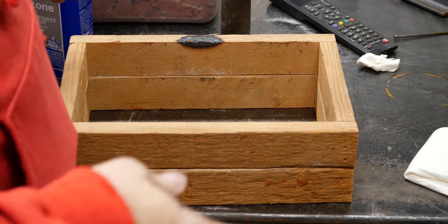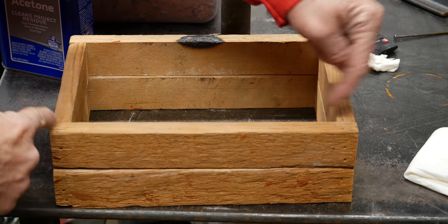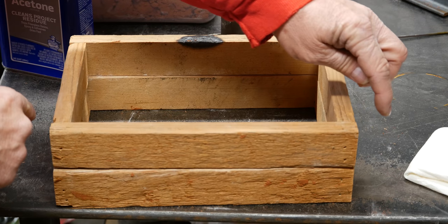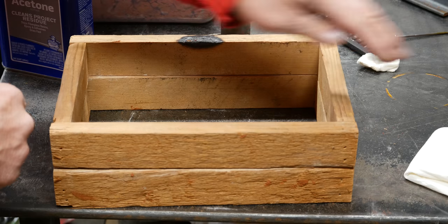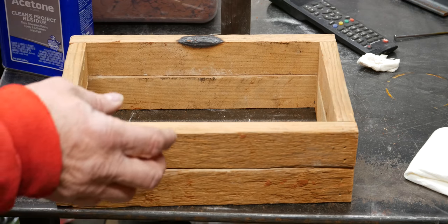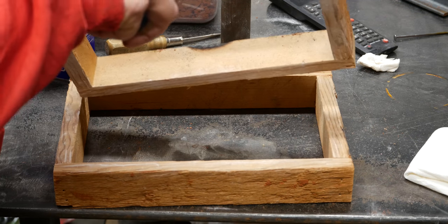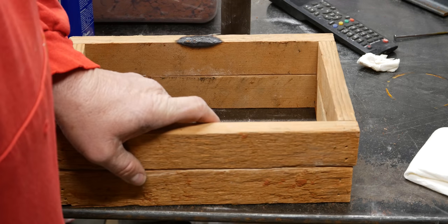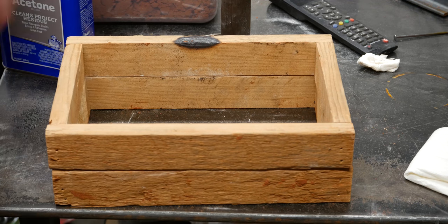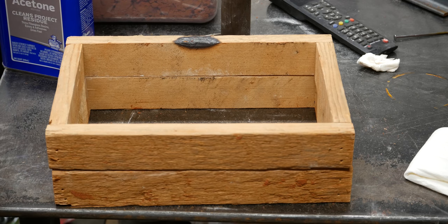So I think I'm going to cut my angle iron. I'm going to do seven inches on the inside, and I'm going to do at least 10, maybe 11 inches — if I've got enough material to go 11, I'll go ahead with that. The angle is two inch, and this turned out to be an inch and three-quarter wide, so I'll be about a quarter inch thicker as well, which will be okay. I've got plenty of Petrobond for that. Let me get the angle marked up and we'll get started cutting it up.